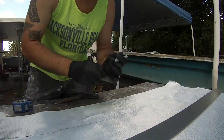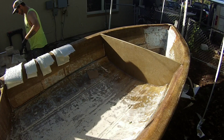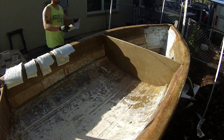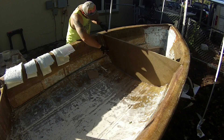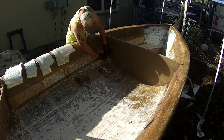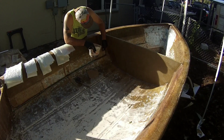I'm doing one five-inch layer, and then I'm going to do a second layer of 1708 at eight inches, so there'll be an inch and a half of overlay on each side. Taking my tabbing material, wetting it out back there in the corner, getting the resin all worked in. Now I'm taking the roller and working in some more resin onto the bulkhead itself just to give the 1708 tab something to grab to. Working the 1708 tab in with my fingers, then taking my scissors to do a relief cut just to help the 1708 lay down better and not cause any air pockets in the corners. Then I take a two-inch chop brush and really push the air pockets out to help that 1708 bind down properly.